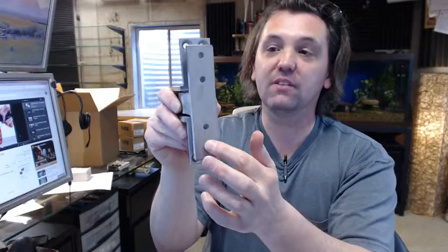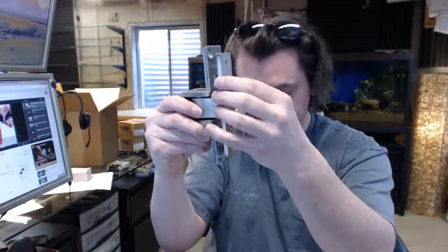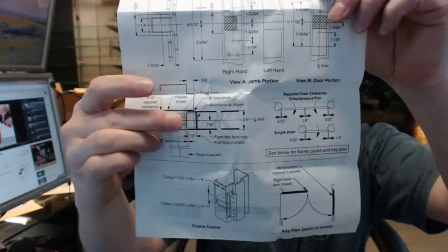That is not typical. Plus, if it is a fire door, you are not going to be able to prep it on your own, because it's not only doing that radius — you then have to do a plunge and prep for the hinge body itself, this leaf of the hinge. For a steel door, you have to do a very unusual preparation as well: a large inverted channel in the hinge stile of the door, so the entire hinge stile looks like an inverted bottom channel. These are doors you will most likely need your manufacturer to make for you, and especially if they are fire doors, they would have to be made by a listed manufacturer of steel or wood doors.